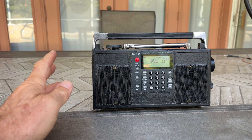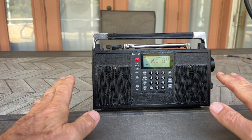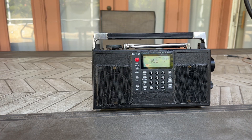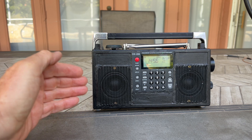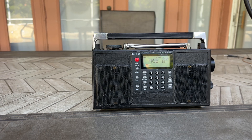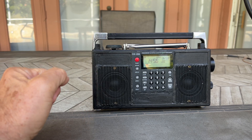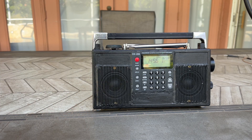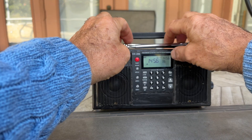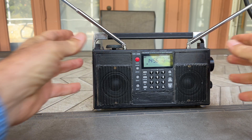Let's briefly summarize what we talked about. First, quality of sound was greatly improved by adding two high-power stereo speakers with enclosed boxes, a stereo amplifier, doubled capacity of the lithium-ion battery, and an equalizer to make sound more natural and extend lower frequency bandwidth down to 100 Hz.